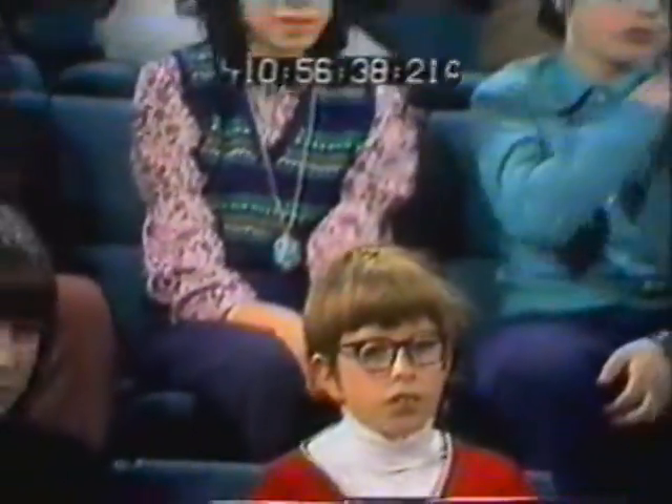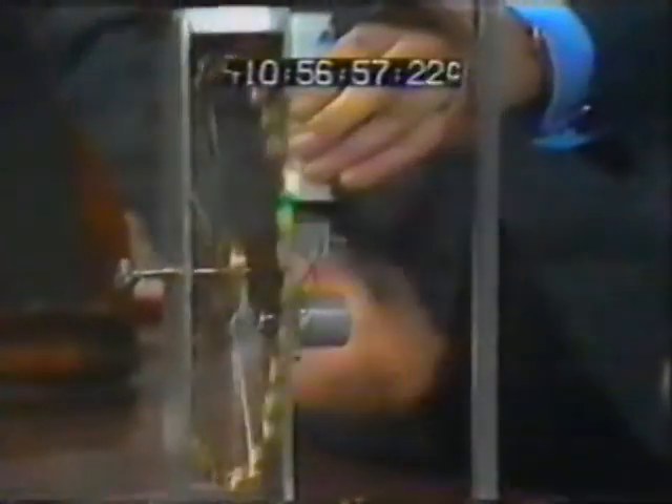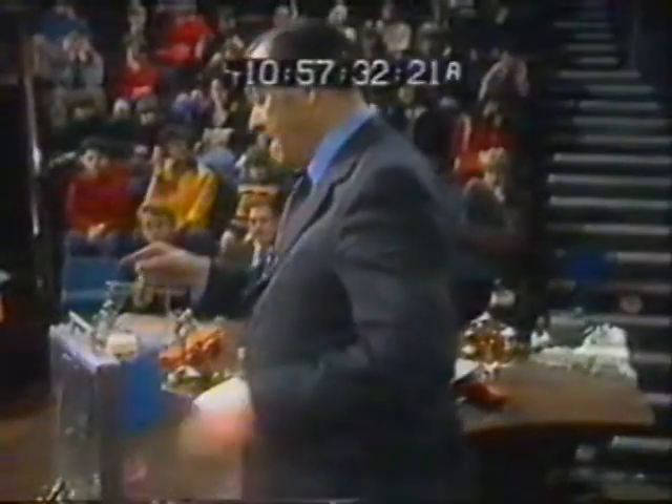If you really want to see our gyro really precess, we've made one in which the rim has been subdivided into a lot of little masses on spring wires, so that when I set it in motion and turn it to the camera you can see: if I now waggle it side to side, the inner ring — you can see the precession taking place, not about the midpoint here, but about the top and bottom. And if I give the inner ring a spin you can see it leaning over like a dinner plate. Incidentally, when you had a gyro going it wanted to maintain its axis of spin — why isn't that stopping the minute I let go? There's one for you to think about; I'll answer that next time.